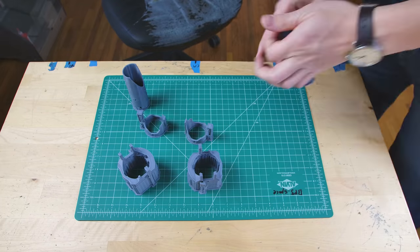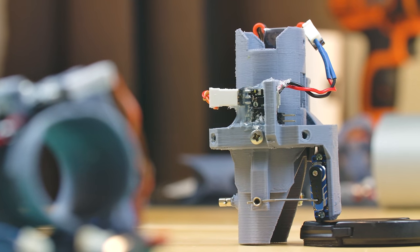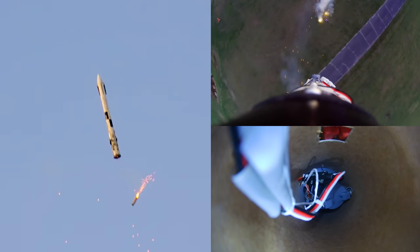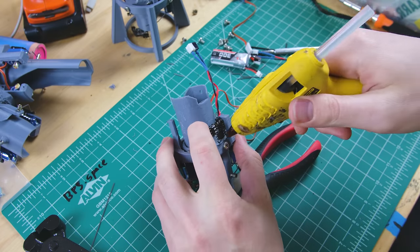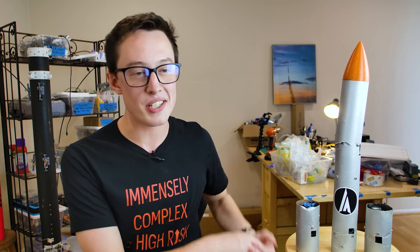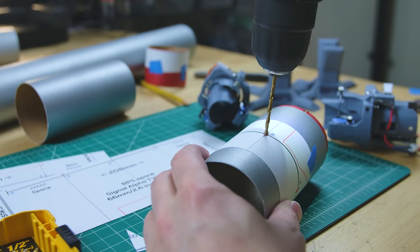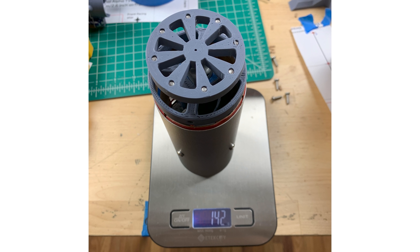So why not do three stages? Each stage has a motor mount, battery, computer, and servos. The motor mount is based on a shortened version of the dual motor mount I designed for Scout E. In order to deal with spatial limitations from the battery and the flight computer, one of the axes of the gimbal has slightly limited range. The final product totally works, but it kind of looks like trash because we use a lot of hot glue to secure the battery and the computer. Hot glue gets too much grief — it's a good way to build something if you understand the limitations of the material. It's like the OG additive manufacturing. The first and second stages will look nearly identical, but the third stage will also have roll control with a reaction wheel. We'll use those two pins on the top of the board to control a motor driver, which controls the reaction wheel on the third stage. When the wheel spins up in one direction, it lets us roll the rocket in the opposite direction.